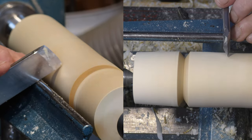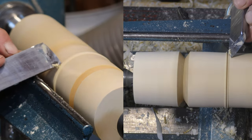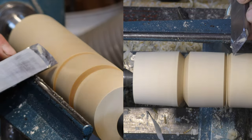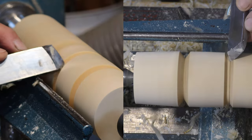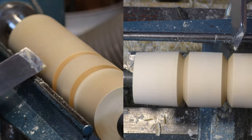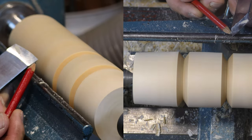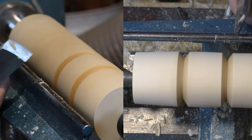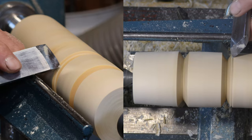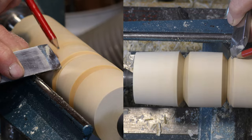Looking at the V-groove again — just a little central cut, pass the tool into the wood, then tilt it slightly left, slightly right. The idea is to have only the bevel side rubbing against the wood. Think in terms of using the point — come down the left side here. As the tool comes in, there's space in behind the edge and the bit I've just cut.